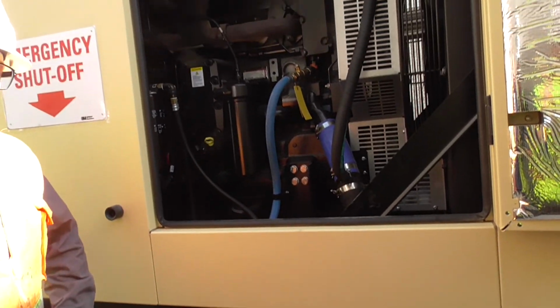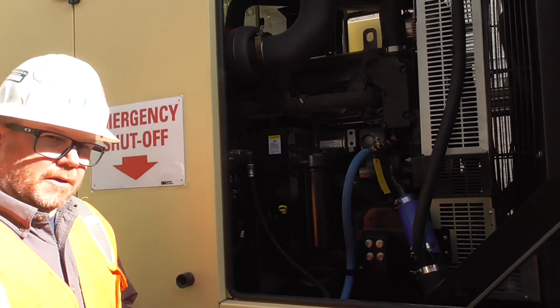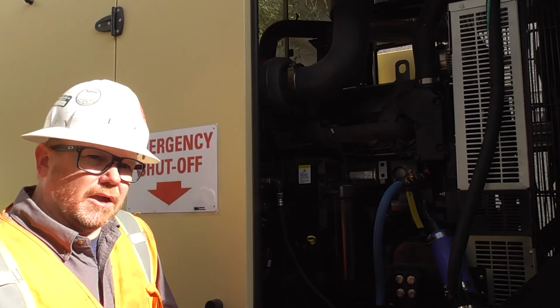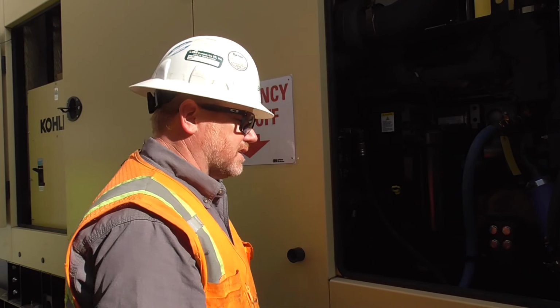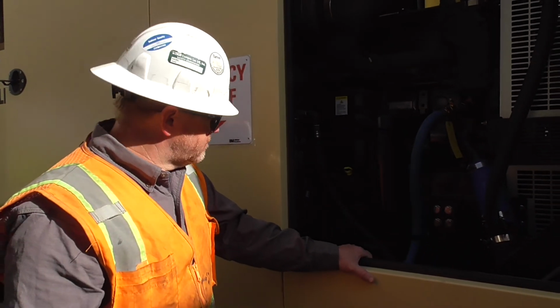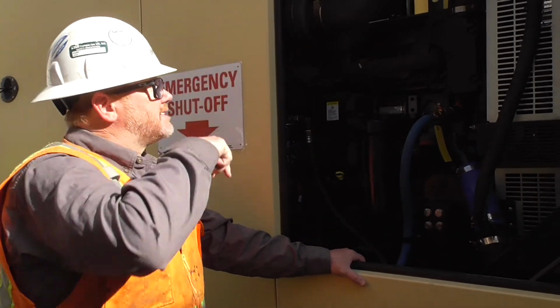So would this be something that we would have to do a PM on? What do you mean by PM? PM, like a monthly thing. Yeah, I would come check the hours. Obviously, you're going to want to log the hours, things like that. Okay. Just give it a look over. Make sure you don't see any fluids on top of the tank. Make sure you don't see anything leaking from anywhere. Just a quick check on the oil level. You can get a flashlight up here. You can't see up there.